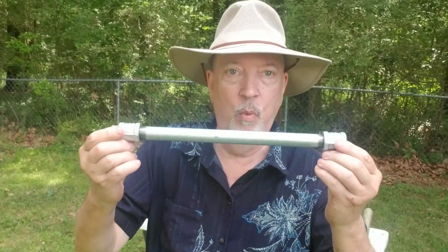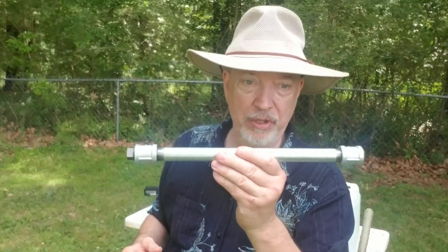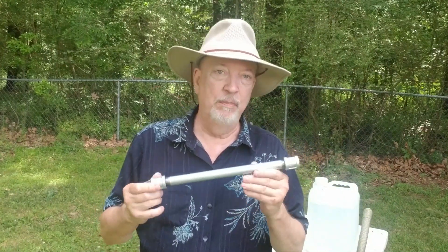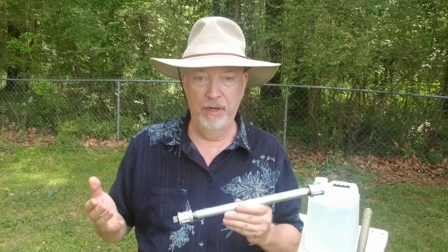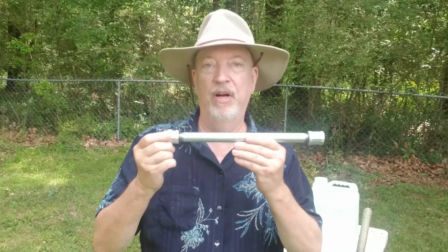This is welded pipe. Among welded pipe there is malleable black iron — the weakest and lowest rated of all, used mostly for natural gas and propane low-pressure applications — and steel like this, usually galvanized, which is higher pressure rated and used mostly for water. This will come back later if there's a part 3 or part 4 to this.